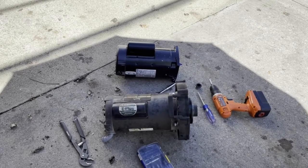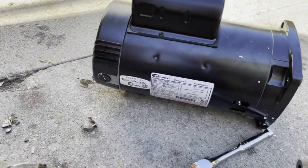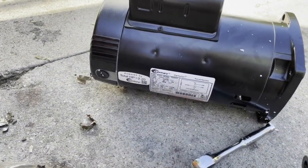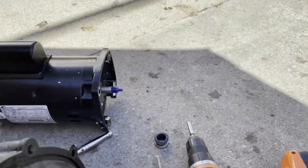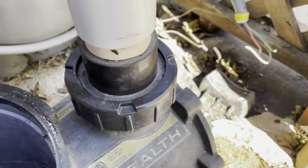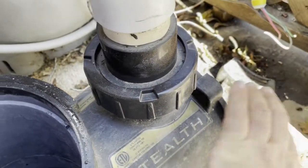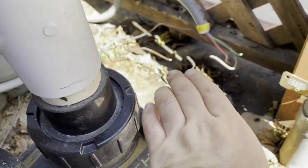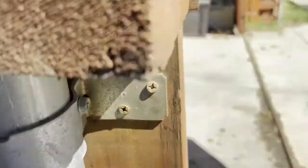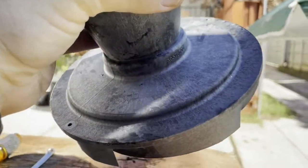That's why I just ordered another motor. The new model is called BE2850, also 2 horsepower. They look alike. The only thing you need to do is remove the power wiring cables from the back of the motor, then loosen the bolts holding the pump to the motor, and pull the motor out.